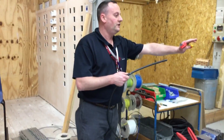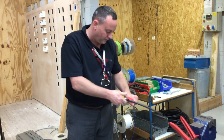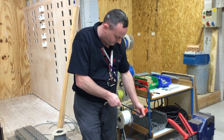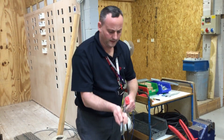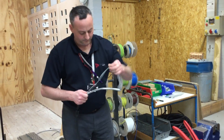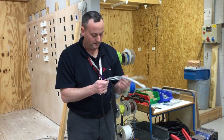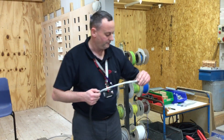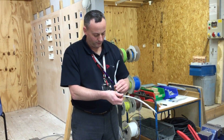Knife - take off the outside PVC sheathing. Sometimes it comes off in one, sometimes it comes off in sections, depending on the sharpness of the knife. Next take off the steel armour and hopefully just take them and break them off. Should come off relatively easily if we've gone deep enough. It's when we don't go deep enough that they become more resistive to being broken off.